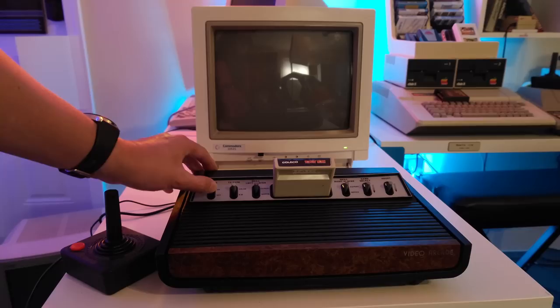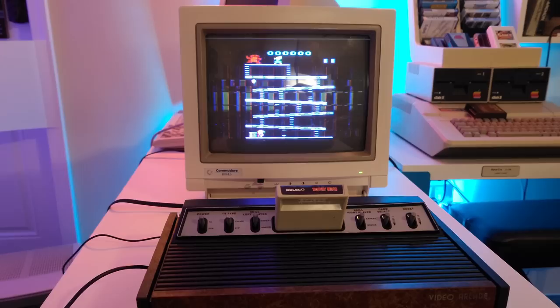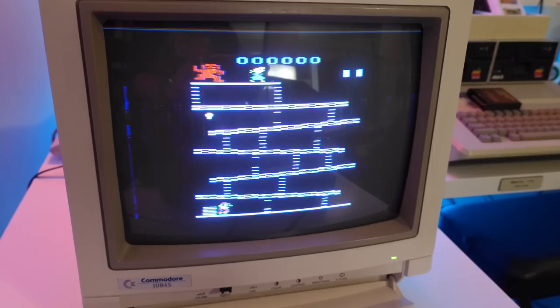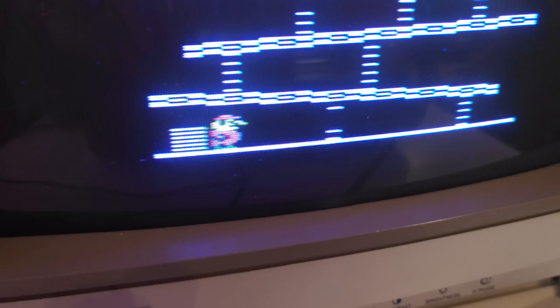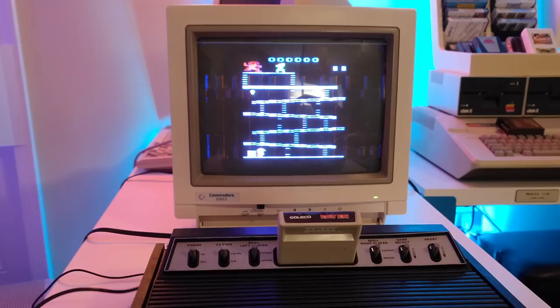And unfortunately not. So I've been talking to the ever helpful Luke at Console 5 and on the AtariAge forums, and the consensus is that there are two different interference patterns. The slow rolling bars look like 60Hz mains power hum. Now I've tried different outlets all around the house, and even a second new power supply from Console 5 with no change. It could also be radio frequency interference coming in on a bad solder joint or even through the video wires. That other stationary interference is digital, possibly from one of the chips.